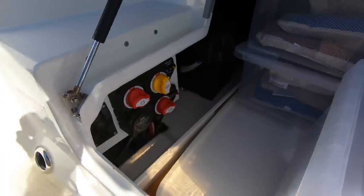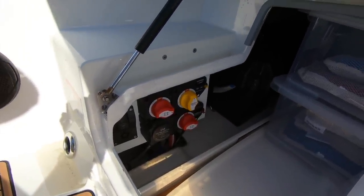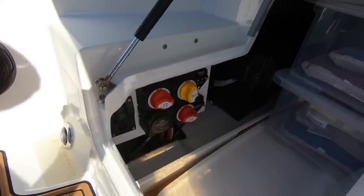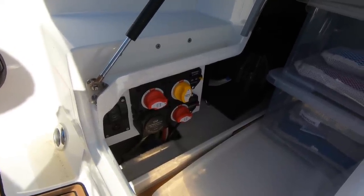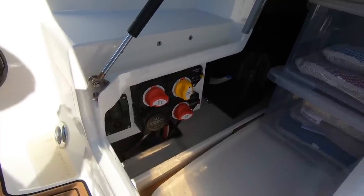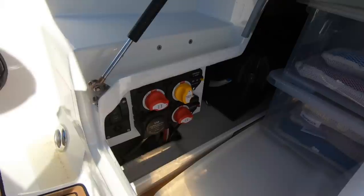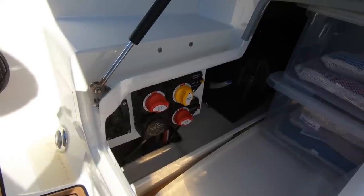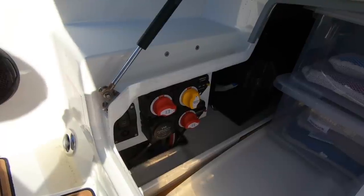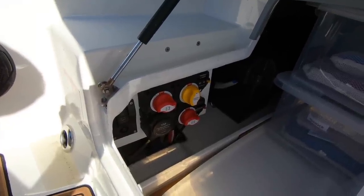One other feature is this auto-voltage relay system. When you are underway and there is plenty of voltage coming into the batteries to charge them, it automatically links the two of them so that both batteries charge. But then when you anchor up and maybe have the fridge and music on, it notices that the voltage is dropping and will automatically isolate the starter battery so that you never run flat on the starter.